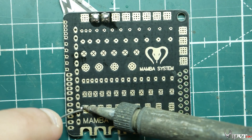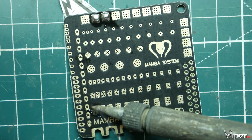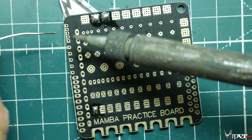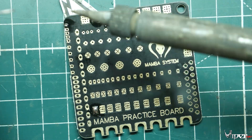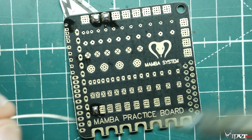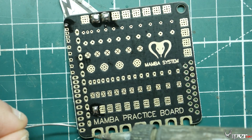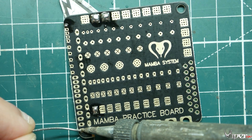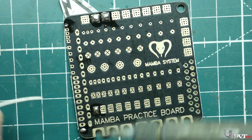You can get some flux and practice how to do things properly. They have these little tiny pads over here too. That's pretty much how I solder — I tin my tip a little bit, or if I have too much I'll wipe it off, then I'll go ahead and heat up the pad with the tip and kind of slide the solder in right underneath like that.